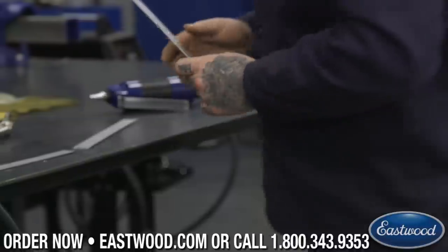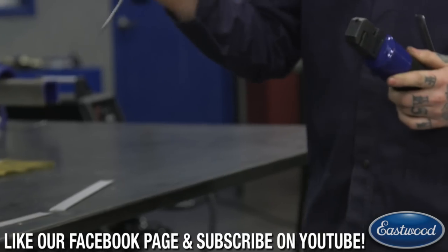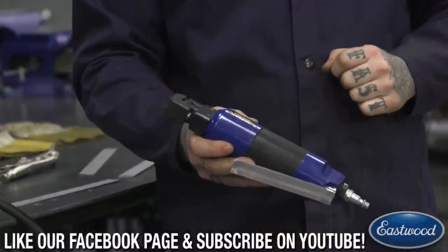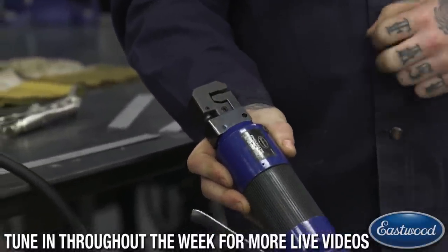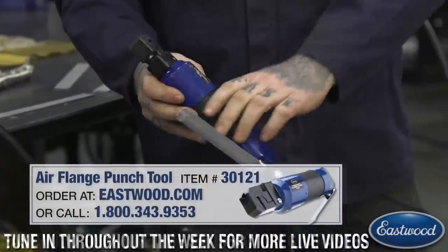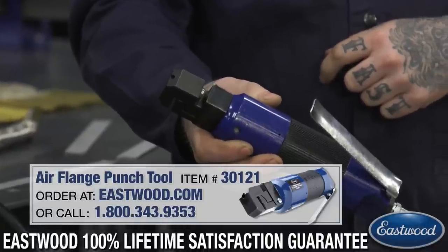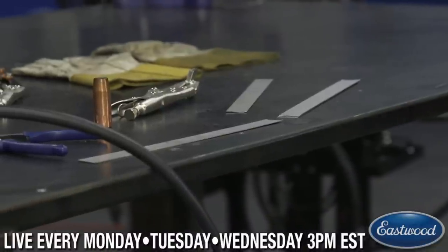The other most common way is to drill or punch a hole in the top layer first. So we have this — this particular one is the Eastwood pneumatic flange and punch tool. It has a flange side so you can flange a panel if you're overlapping and repairing a panel that way, but the side I really like the most is the punch side. If you've ever drilled a lot of holes for spot welding a panel together, you'll probably never do it again after you use one of these.